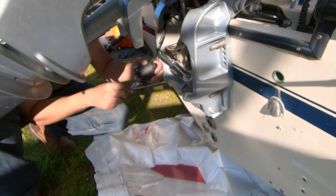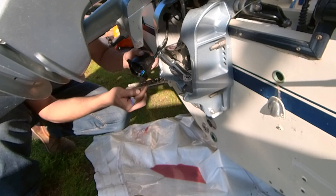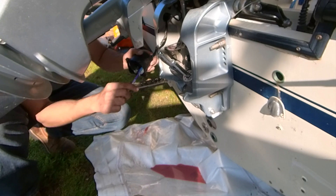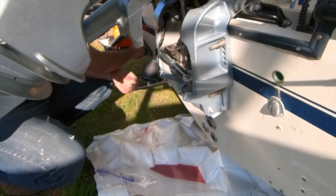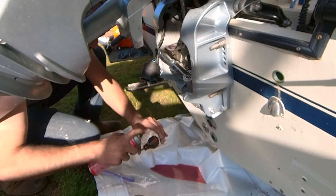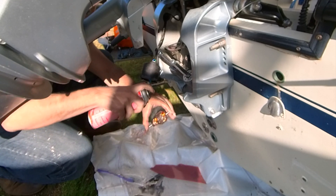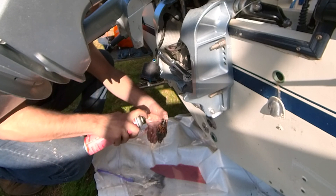It's supposed to be great for this job — if it's good for your brakes it's good for this one. If you use WD-40, a lot of water-based stuff, a lot of oil and stuff is going to stay. Oil is okay but not water-based stuff. This is the best to use. Now you see the armature looks black — I will brush this out too and make sure everything is dry. Look at all this black residue coming up!